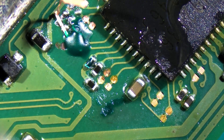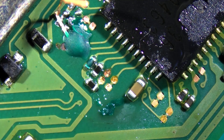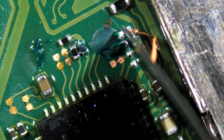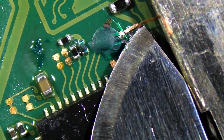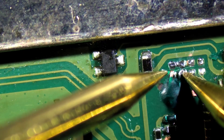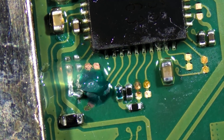Looking good. UV light. We're going to put a little hot air on there to finish drying that up — make it look more opaque instead of so glossy. We're going to go ahead and cut this trace off right about there, like so, and remove that guy — don't need the end of that on there. Perfect. Just checking to make sure we got the right reading there — everything's all connected and working like it should.